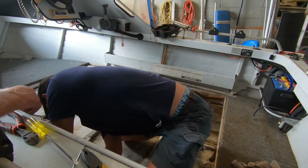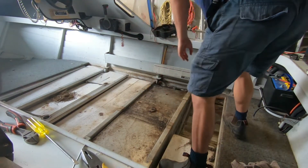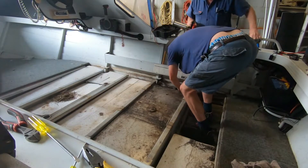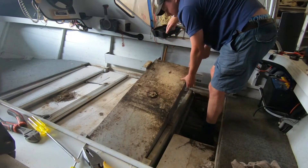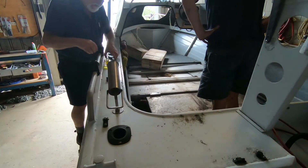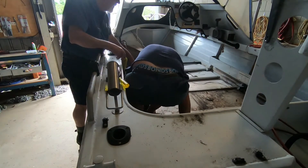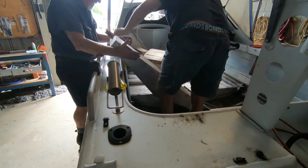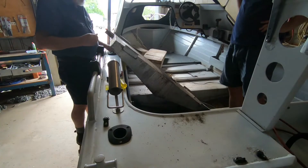You might have to pull the hose that way and that way a bit. You've broken the seal — now you're going to have to lift the tank out that way. Lift the tank up on that side, way above that. We're going to lift this tank out — this end has to come up. That's all sealed that end, grab it around the throat. We're dragging it this way at the same time. There's fuel in the boat. Now the big trick — put a towel down here. I'm more worried about the fuel spurting out once you tip it.